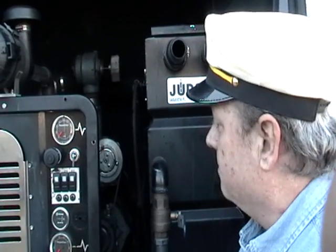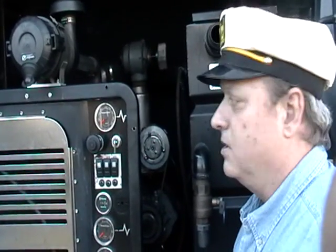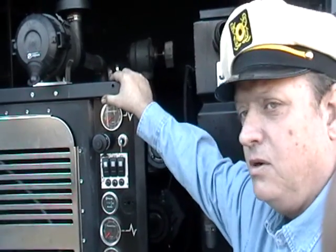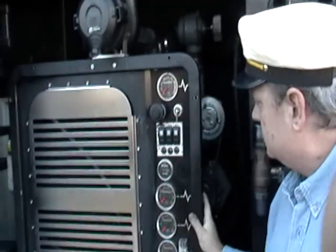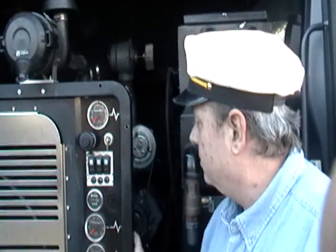It's using half the amount of fuel. But even at half throttle, it's around 600 CFM — and like I said, only 200 CFM is actually going through the wand. This machine will now maintain 240 degrees on a high-flow wand under commercial carpet cleaning conditions. Personally, that's too hot for me — I would turn it down to about 220.